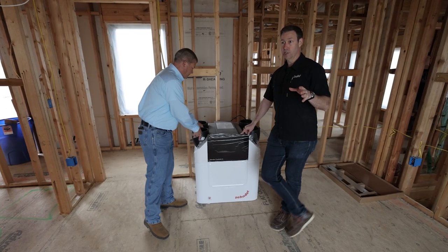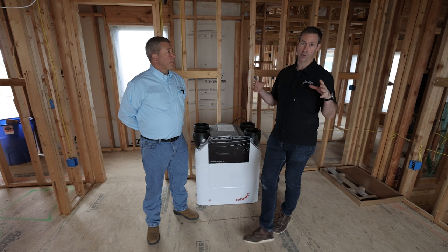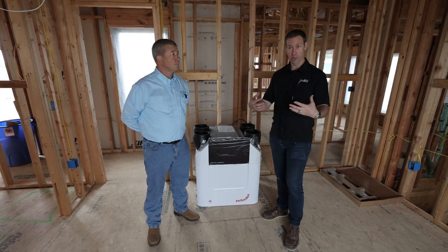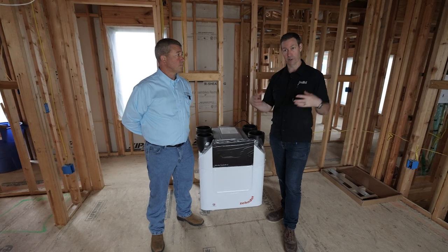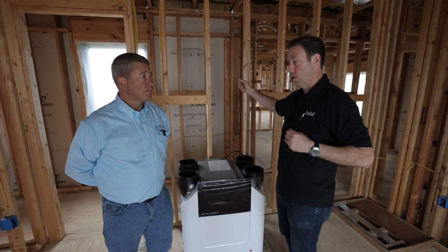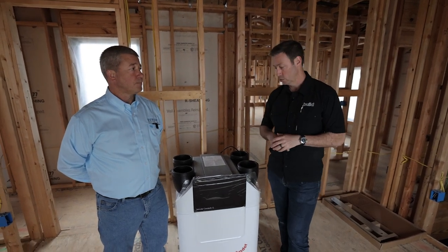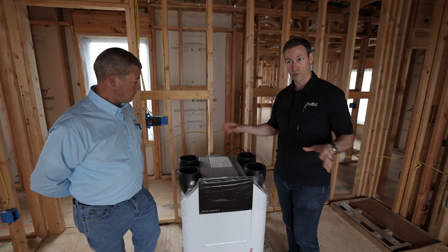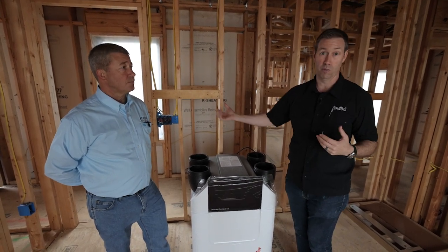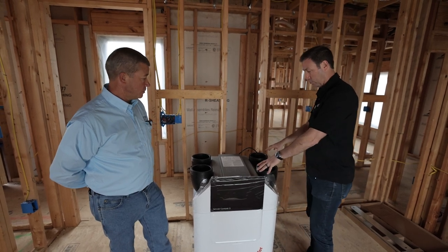So if you haven't seen our Zehnder fresh air videos before, let me boil it down into the 3 minute version. On this house, we built it very tight. The builder's doing a great job. Steve designed a very tight house. So we want fresh air to come in because we're not having air leak in through windows, through various cracks and crevices. So this unit is going to do all our fresh air, instead of a return air fresh air like is pretty common in Texas, or maybe bringing the fresh air in through the dehumidifier.